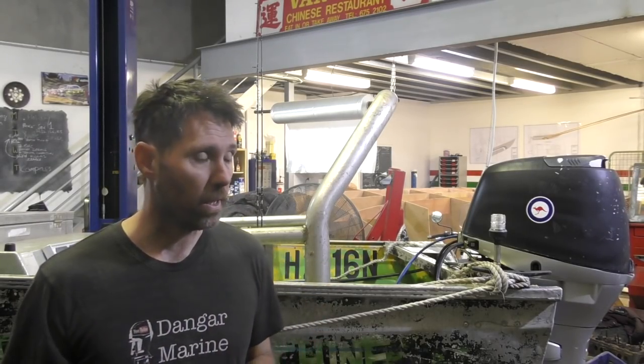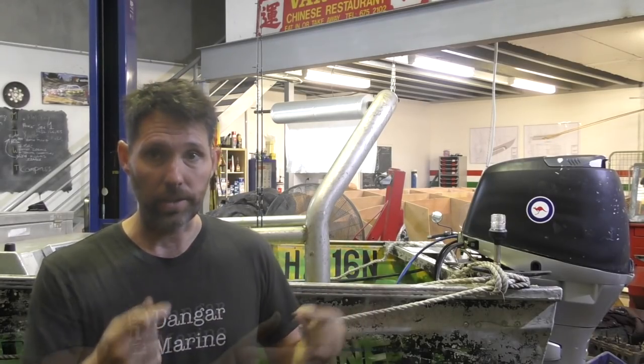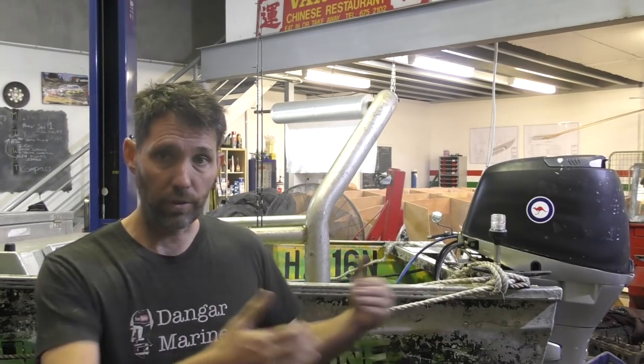It's very hard to manoeuvre a boat when you're towing another boat if you're towing from the transom. By having your tow point further forward in the boat — forward of the outboard or the rudder or whatever — the boat you're towing with becomes much more manoeuvrable. So that's sort of where this idea started.